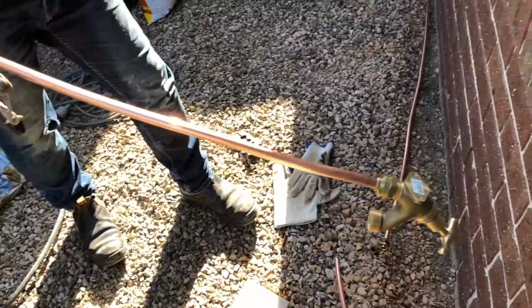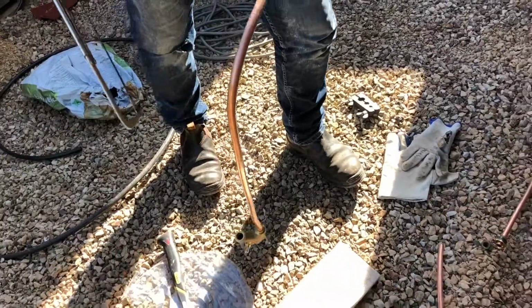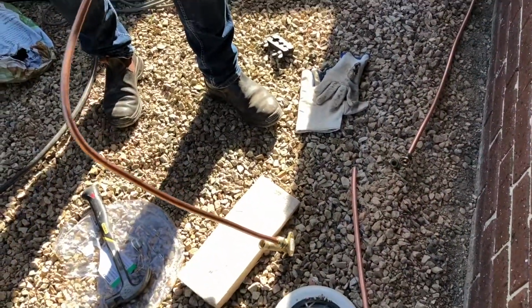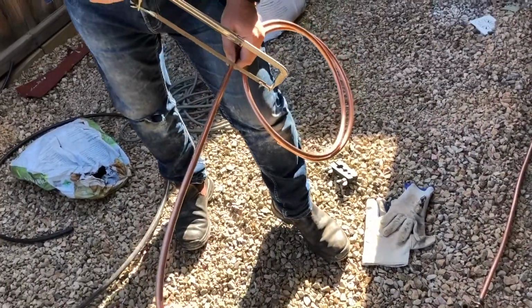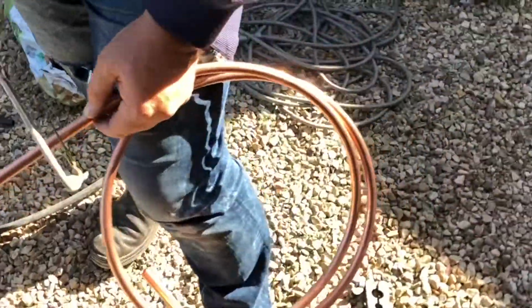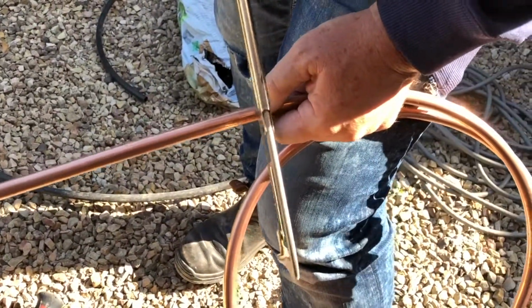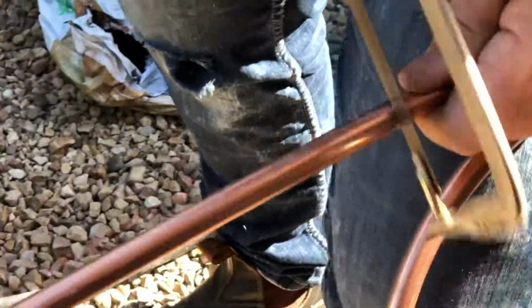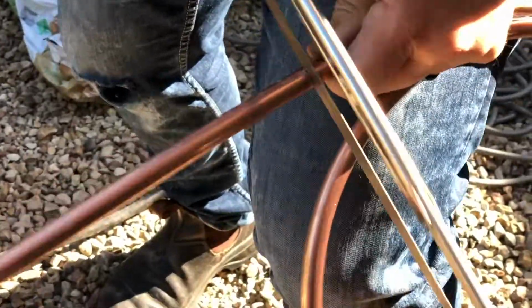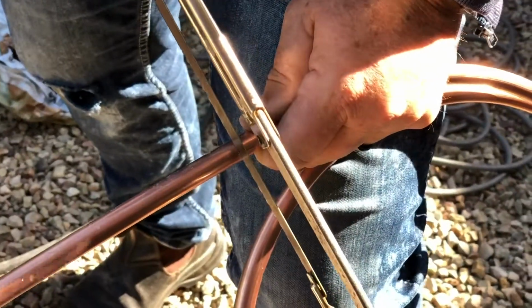We've bent this all up, we've got the tape and bent it to where we want it and measured it. So I'm just going to show you cutting the pipe just using a hacksaw, and I do find a little bit of a blunter hacksaw makes it a little bit easier. And I've got my mark here. And what I do with the fingernail when you're cutting something like this, just sit it on your nail like that and then cut. And then once you've started, you can cut it through. And copper pipe isn't hard to cut. You see a few strokes and we're through like that.